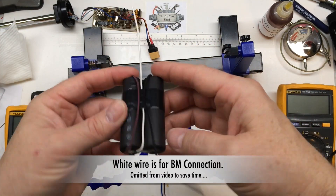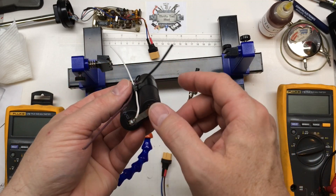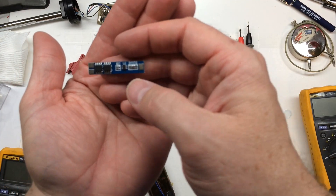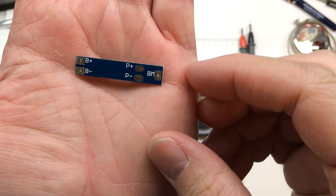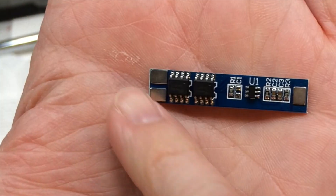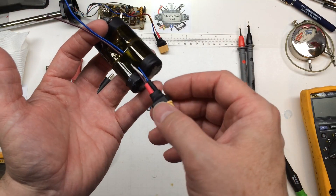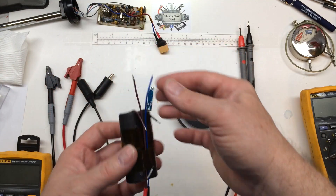That's got all our connections on the pack itself. I'm going to put a little bit of silicone on here, let it dry, and then wrap it with some electrical tape to seal up the ends. We'll be ready to add the protection board. I've received my 2S board for battery protection. We have P-plus and P-minus terminals for charging and power output, B-plus and B-minus pads, and the middle connection. I've already got my power leads with the XT60 connector run through, and I'm going to solder these leads to the P-plus and P-minus terminals.